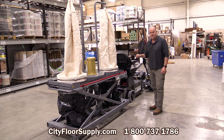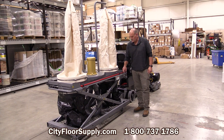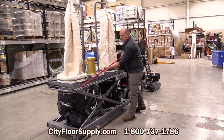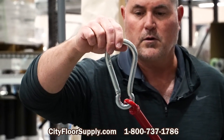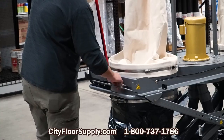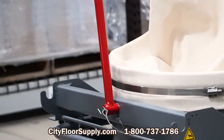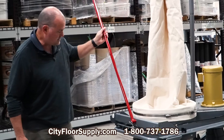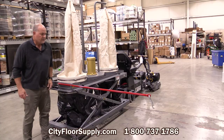The American Sanders gym floor vac hooks into where previously the rider's cord holder and hook were. What they've done is provide a new cord holder in its transport spot, which are these clips here. And as you can see, there's a large carabiner for your cables. We're simply going to put the cord holder in on that stud and then put in the clevis pin to retain it, and we get left and right side depending on which side you're running for your gym floor cord.